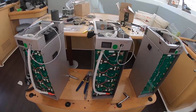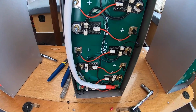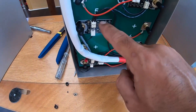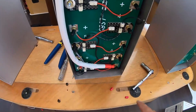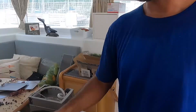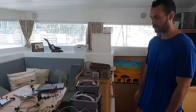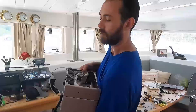Almost done — I just have to organize the cables on top, but on the front it's pretty nice, already set up with the cell modules communicating in a chain. We have positive on one side and negative on the other — the negative comes through a fuse and connects to an Anderson connector, and that's how we connect them to the boat. All four batteries now have the cell modules installed with the cable going to the cell group module. Now we're going to move the batteries back to the room and start connecting. We had already planned for this and spoken with the company, and everything seemed to be on schedule. But then we started doing the installation — let's show you guys how it went.